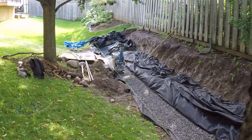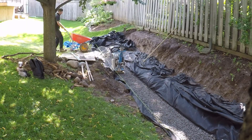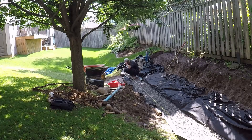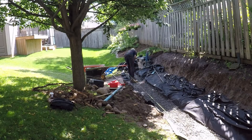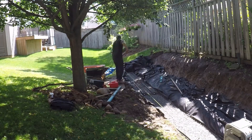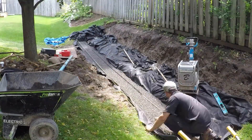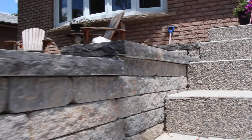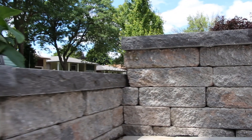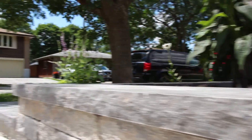If you're going open graded base, that water is going to work its way down into the base material — lower than your wall by six to eight inches, since that's the depth we prepare base material for retaining walls, along with a six inch embedment of the actual wall, putting you about twelve to fourteen inches down. If we're building on top of dense clay, the water is just going to sit there and saturate with nowhere to go. But with a slope building up towards the retaining wall, we can dig an outlet for the water to move away from the base. However, if the slope is level with or slopes down towards the retaining wall, there's no outlet and no lower area for the base to drain into.